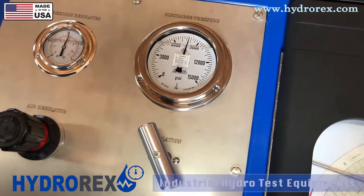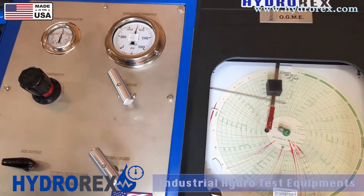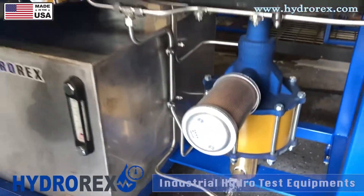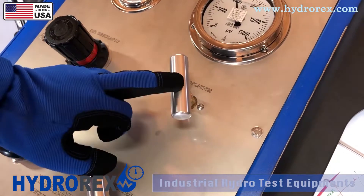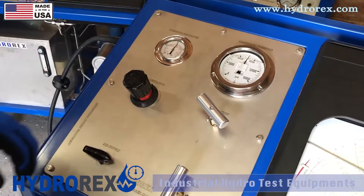In my procedure, I'm required to leave it 15 minutes with zero drop. All of our pumps come equipped with an internal check valve which retains backflow pressure. But I always recommend closing the isolation valve to extend the life of our pumps.